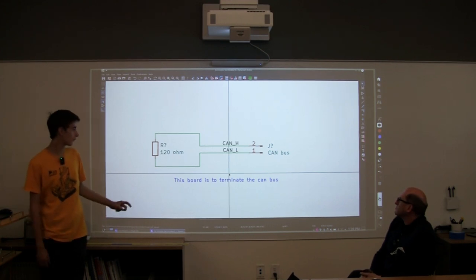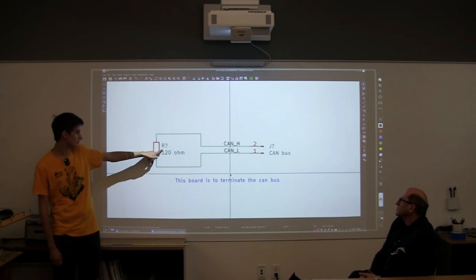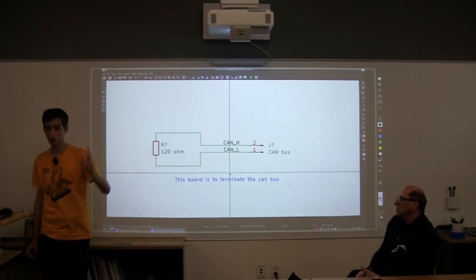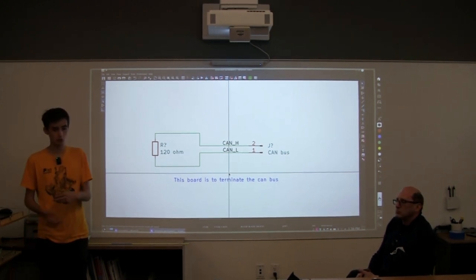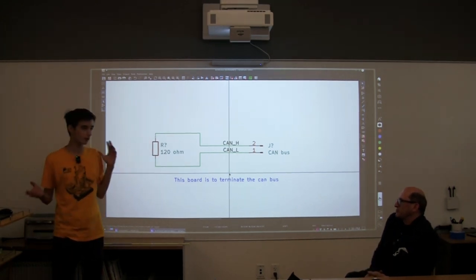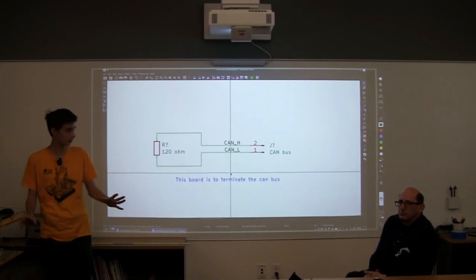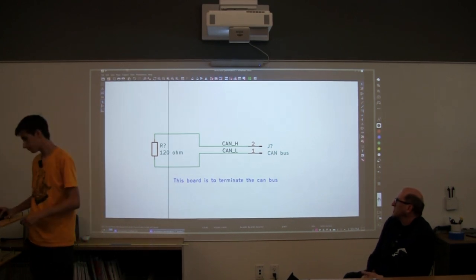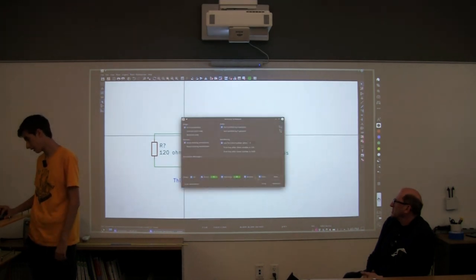We're really close. So now, going back to these reference numbers, these are really helpful, like I said before, to reiterate. They let you know, when you're actually making the boards, what parts go where. And when you buy your parts, it's super easy to sort them out. We don't actually have to do this on a small board like this, it's not that hard to do it yourself. But on bigger boards where you have tons and tons of parts, you don't want to go individually doing these things. There's a bunch of helpful tools, but we're just going to use this one called Annotate Schematic.